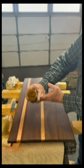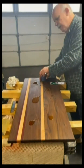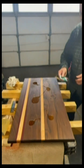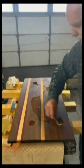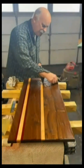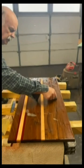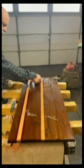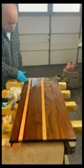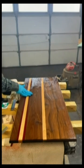Let's put a little bit more and spread it around very sparingly. It might not take as much this time because it's the second coat, so it might not soak in quite as much. I'm going to let it sit for a few hours more, then come back and do a final light sanding. The final coat will be a lot thinner than this one.